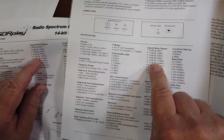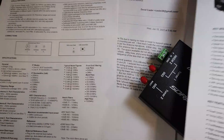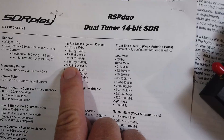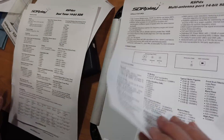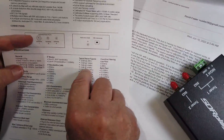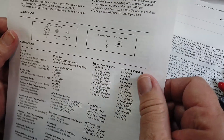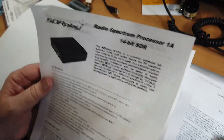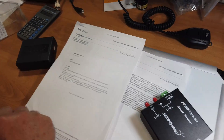So that's much better in terms of noise figure. At 100 MHz, noise figure really matters. Looking at the RSP Duo, the noise figure is back to 3.3 dB. So we see that the RSP-1A came out first, then the DX, then the Duo — and there's a noticeable difference in noise figure in the 100 MHz region, which is where you're doing your broadcast band DX. Also, all of them give a 10 MHz snapshot of whatever you're tuned to, which for broadcast FM isn't a lot since the channels take up so much space.